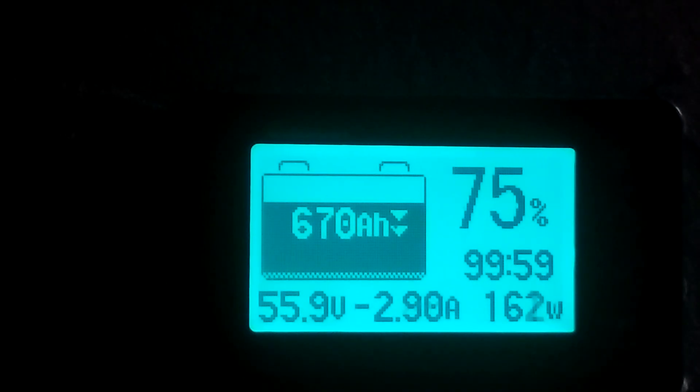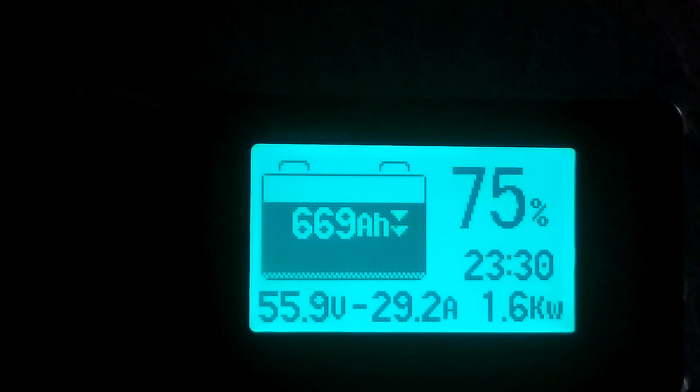Alright guys, it's been about three minutes and it hasn't done anything yet. I'm going to go back and see if the fan or anything is blowing. I turned the thermostat up a couple of notches and it came back on again. But I don't think I'm getting true readings because when you turn the thermostat up it's going to boost the compressor — spin it faster — because it's going to make it think the room needs heat, so the compressor is going to start running harder, which gives me false numbers. I might have to do this test over again. But even with me bumping the thermostat up a couple of degrees, it's still only running at 1,500 watts.